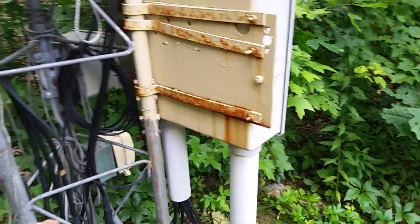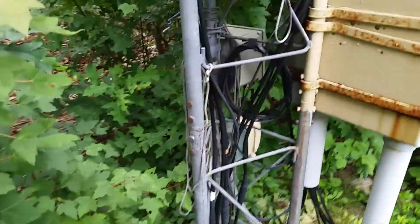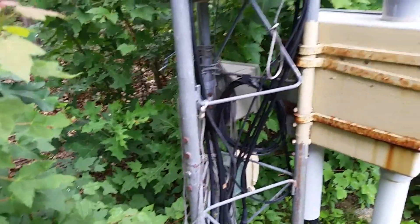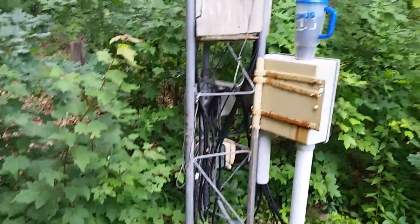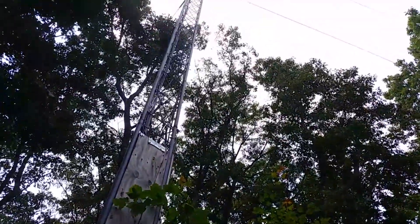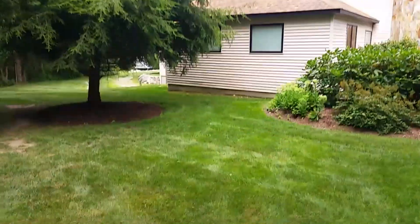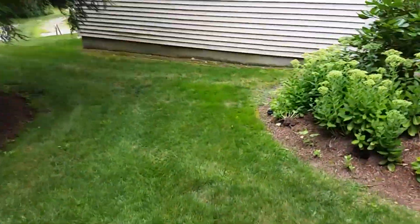Where cables change direction going into the box to the basement, you should also have more grounding kits, because when you've changed direction those should also be bonded. There are several things I did not do properly when I put these in 20 years ago — you're always learning. The only good thing is that the tower is well grounded and the mast sticks significantly above any of my communications devices, so it's better than nothing, but not a solid copper ground.